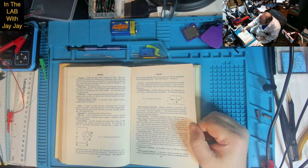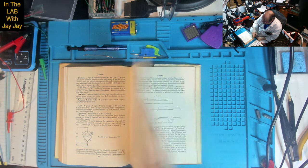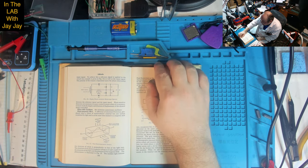Certain properties concerning the motion of orbital electrons in an atom are indicated by 4 quantities termed quantum numbers. The Pauli exclusion principle states that no 2 electrons in a neutral atom can possess the same set of 4 quantum numbers. Peak detector, Peltier effect, penetrating waves, penetrating device, Phantastron time base, phase sensitive detector, phase shift oscillator, photomagnetic